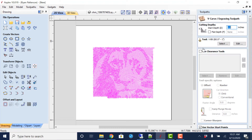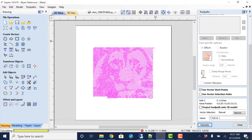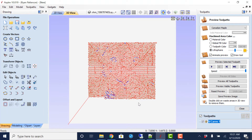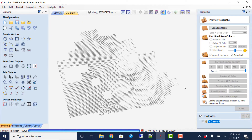You might think that's a drilling toolpath — which it could be — but a drilling toolpath would require several different depths based on the diameter of each circle. The V-carve toolpath is going to automatically create the right size hole depth based on the diameter of the hole and the angle of the V-bit selected. I'm going to use a 60-degree V-bit, not setting any depth manually, and click Calculate. It's telling me I have some overlapping vectors — I'm not going to worry about that for now, so I'll continue anyway. It is taking a little bit of time because there are a lot of little holes.